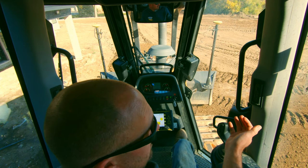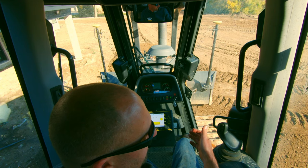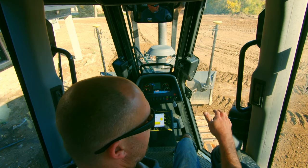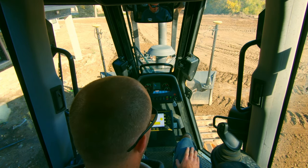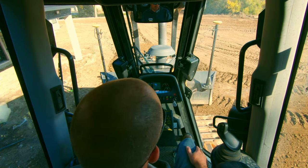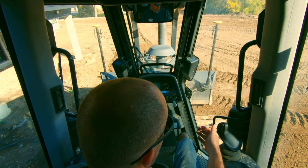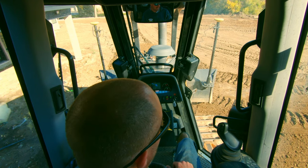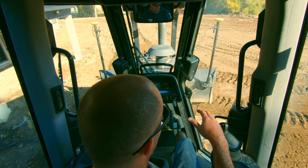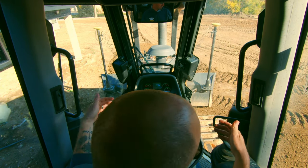I don't really have a ton of dozer tips and tricks beyond this: the biggest thing in dozers is seat time. Get in the dozer, figure out what level feels like, and figure out those pitches and rolls so you can tell what your blade's doing. Everything happens on a delay with a dozer because you're tracking over the area you're pushing. If there's a mound and you push through it with your blade, you're tracking on the smooth area the blade created. If you jump the blade up while moving forward, that creates a speed bump — but it takes a second for your tracks to get there. Visibility in dozers is also not very good. You can only see the corners of your blade and the backside of the blade.